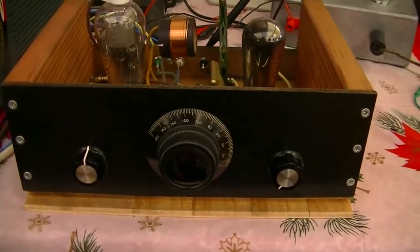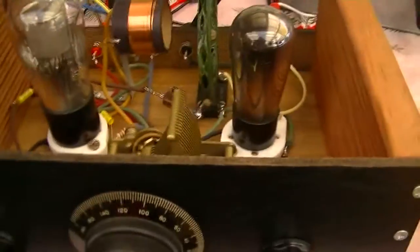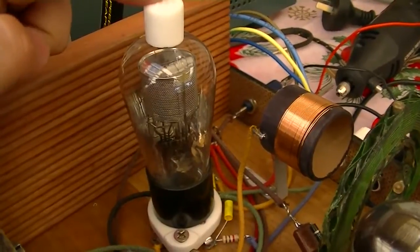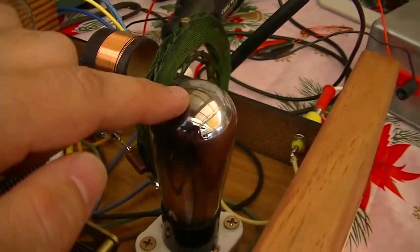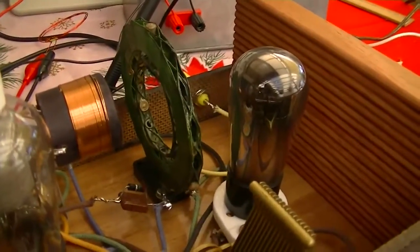The parts used in the front panel are just some leftover masonite; the bottom part is a floorboard — bits of decking, like this decking over here. For the interesting stuff inside, we've got a type 32 tetrode used as a regenerative detector, and a type 30 triode used as an audio amplifying stage.